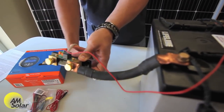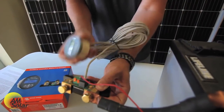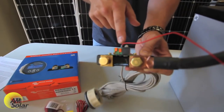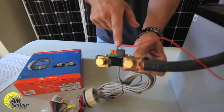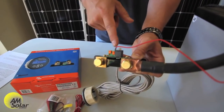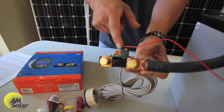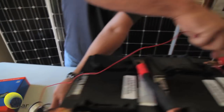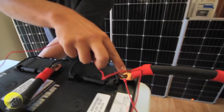In the COM port of the shunt we have a communication cable that goes to the meter. One common configuration is the red power cable that supplies power to the whole unit — that connects to the green port closest to the COM cable — and this goes all the way to the positive of the most positive battery.